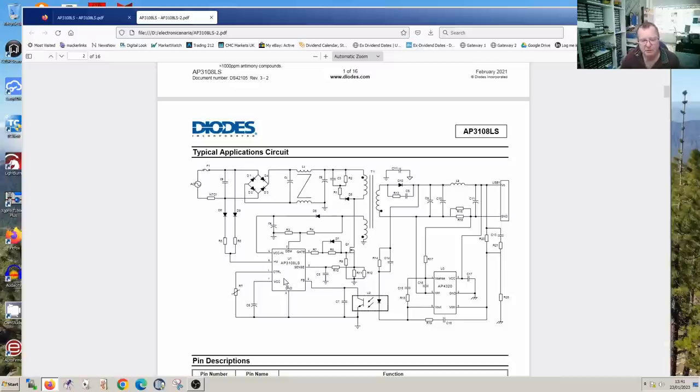That's how it's supposed to work. So the first thing we really need to check is, do we have a voltage on HV, pin 9? Do we have a voltage on VCC, which is generated from the chip? And afterwards, maybe, do we have anything on VCC in? So that's pin 9 and pin 7 and possibly pin 4.